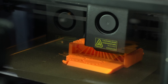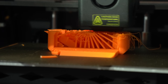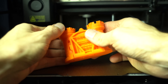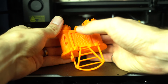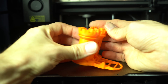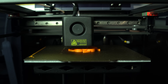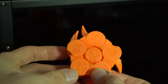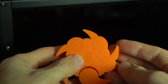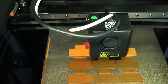The print was looking good until the nozzle caught one of the overhang test pieces and broke it off. After that it started to go downhill fast, so I cancelled the print. The next test was the Maker's Muse Clearance Castle. It took me a while to realize that the left tower is a puzzle and not just an ordinary tolerance test, but the print quality was great, and I was eventually able to remove both the tower and the door. For test 3, I tried the Maker's Muse Tolerance Gauge. The pieces moved easily down to 0.3mm of clearance. I noticed some elephant's foot on the first layer that prevented the other two pieces from moving, so I enabled elephant's foot compensation in the slicer and ran flow calibration using the built-in tool in OrcaSlicer.